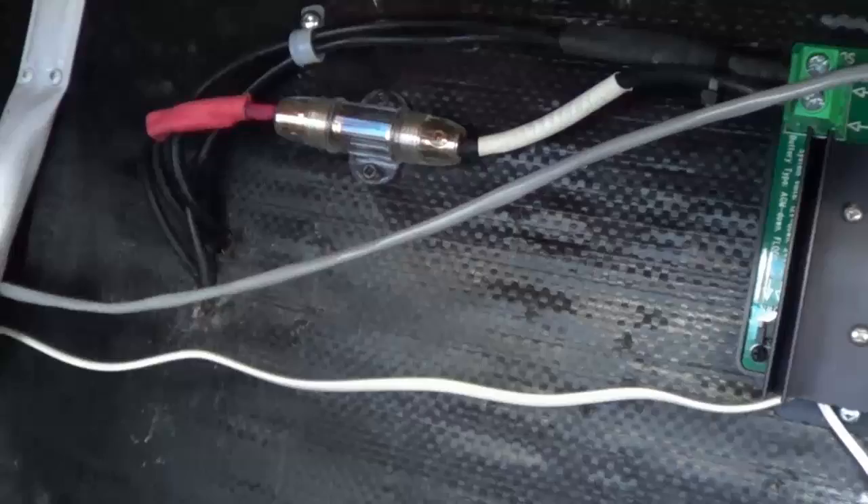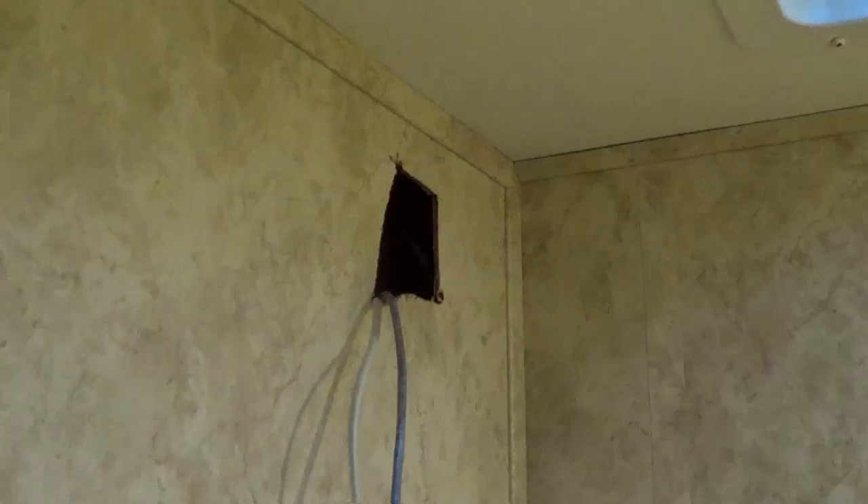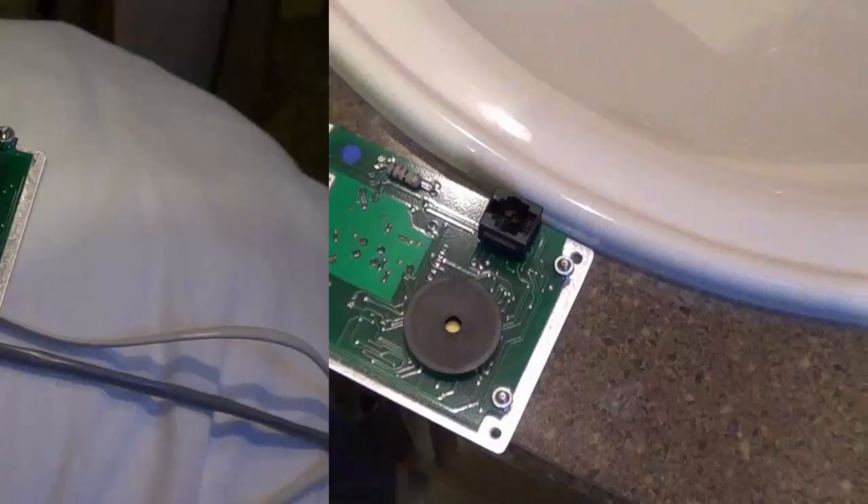I've got my wiring that has to go into where my TriMetric is. Should be pretty easy because I'm just going to follow the same path that I hooked the solar wires up. So I fished it up through the rig and out to my boo-boo hole from the last video — that's actually where I'm going to mount the monitor now, cover up that hole. That's where the solar wiring goes. So now I have lots of cable — I'm going to hook up the monitor connections now.